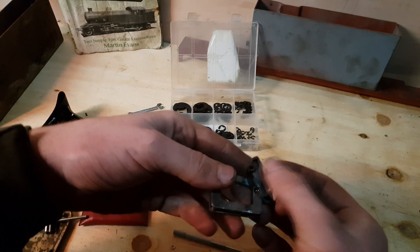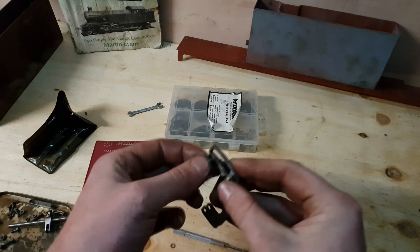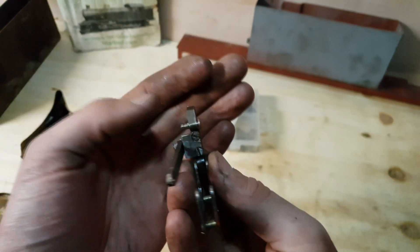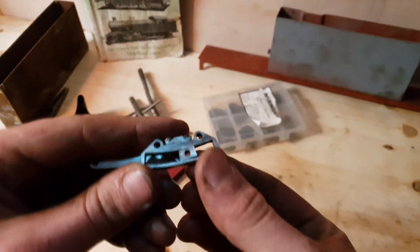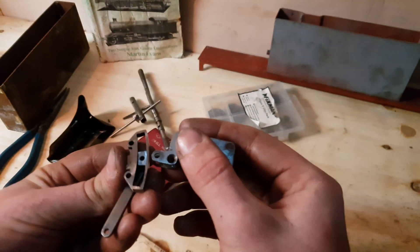They'll look quite nice as you can see — they're about the right size. So this is a little shaft I've machined and it goes in quite nicely — should be spot on. The shaft that's going to go in the expansion link in the middle in that block actually has to be recessed inside the valve gear, or else it will collide with the expansion link itself. You'll see what I do with that in a minute.